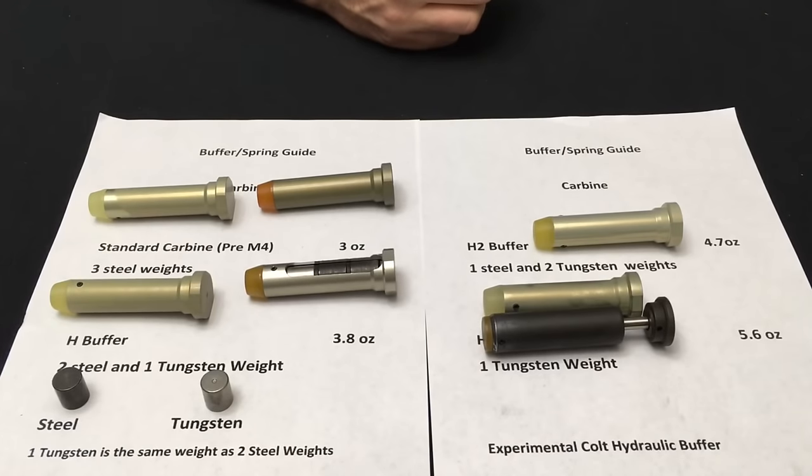The first 9mm buffer is the two-piece 'selectifier' buffer. You can see how it's pinned in place with a piece of rubber inside. On fully automatic fire this absorbs the shock necessary to prevent light strikes — so this would specifically be used for selective fire, though it can also be fired in semi-auto-only variations. The next one is the exact same weight but a solid one-piece buffer. Colt has sold these for many years in their 9mm semi-automatic-only carbines. However, if you were to fire this solid buffer in a selective-fire 9mm SMG, you would have issues with light strikes.